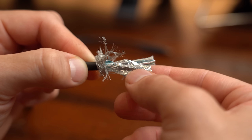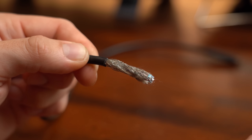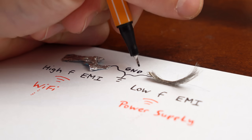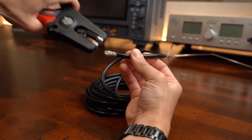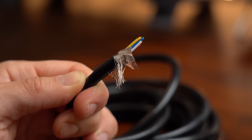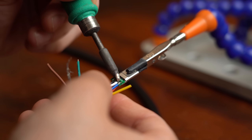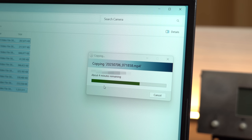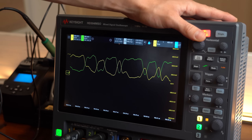This shielding is important to protect the data wires from EMI — electromagnetic interference — which occurs when using WiFi or when a switched-mode power supply is pumping out current. Small interferences are usually not a problem due to differential signaling, but we might be exceeding limits here. We use a thin aluminium shielding covering all wires and a thicker braided shielding with some gaps — two types to block different frequencies of EMI — and we connect the shielding to ground to short out interferences. I got new shielded cable, soldered the wires to breakout boards, and the data transfer test worked perfectly fine.